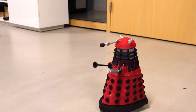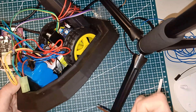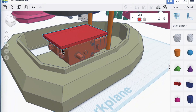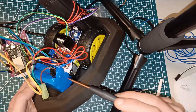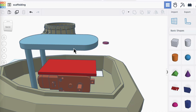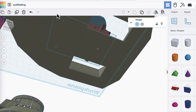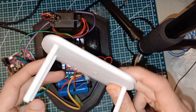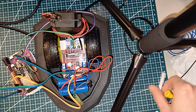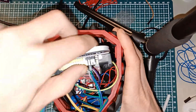Once all the power troubles were solved, I needed to figure out how to fit all the electronics inside. The motors were simply glued with a hot glue gun to the chassis, and then I designed and 3D-printed a rectangle to glue on top of the motors to hold the motor controller and the amplifier for the speakers. The battery fitted nicely in front and the speakers went to the back of the chassis. The only issue was where to put the ESP32 board. I spent quite a lot of time designing and redesigning a scaffolding to make it sturdier, but in the end I decided it wasn't worth the effort and simply made it into another rectangle with rounded edges.